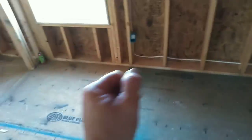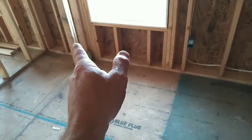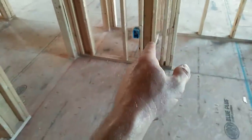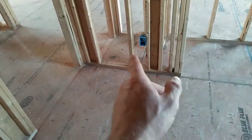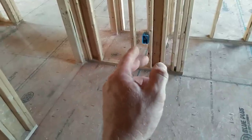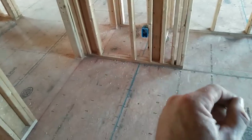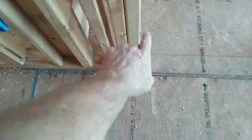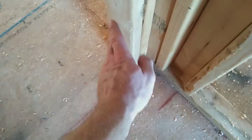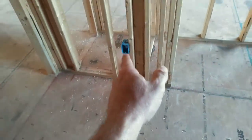That outlet to that outlet is within 12 feet, and that one to that one is within 12. From the corner of the jamb on this double closet, it has to be within six feet — and that outlet accounts for that. We also have an outlet that lands behind a door: this wall is over 24 inches. Code requires an outlet on any wall over 24 inches, point of door to point of door, so I have to put one there to meet code.